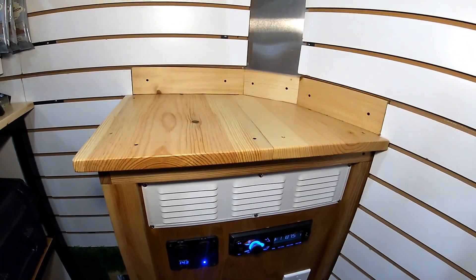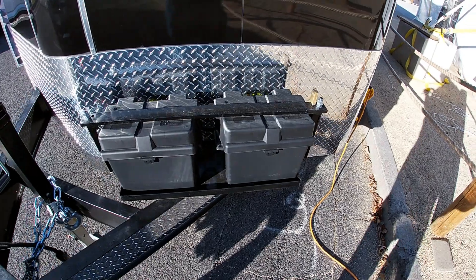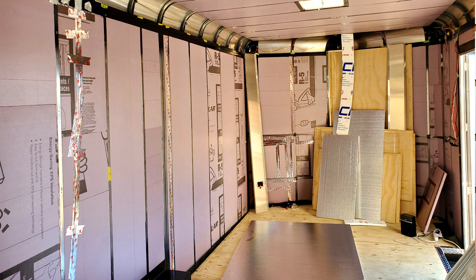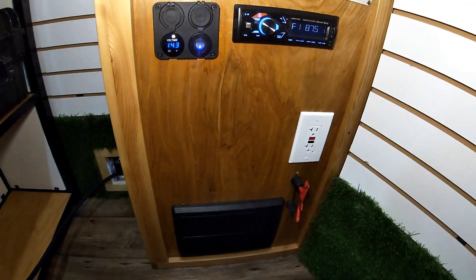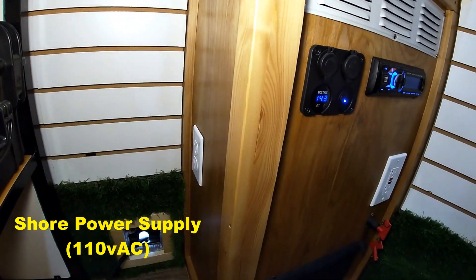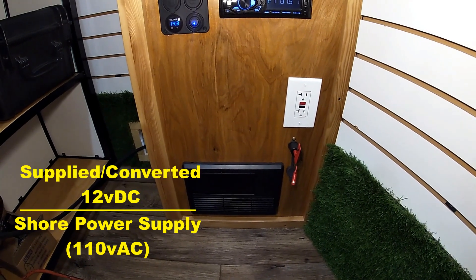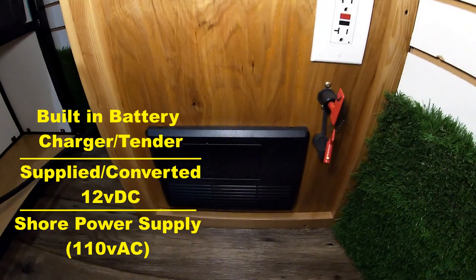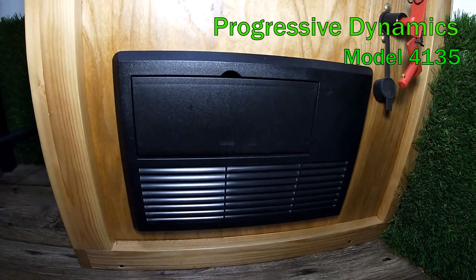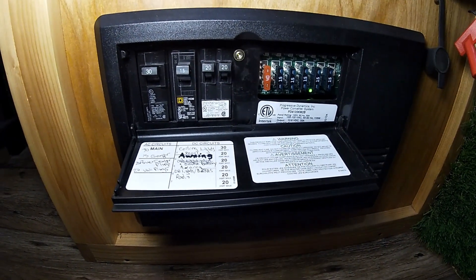Let's take a look at the power center I built here. Remember, this trailer was just an empty cargo trailer. I do have two 12-volt batteries that were already installed on the other side of this wall, and there was a fuse block right in the corner that would supply power to the awning and also the lights — just two little tiny lights inside. So basically I had to come up with a way to have shore power so I could hook up even to a generator for 110-volt power. I also wanted 12-volt direct current and to be able to charge the two batteries. This little guy does all of that for me. This is a Progressive Dynamics model 4135. I'm really happy with it.